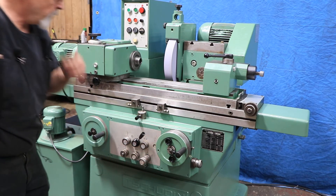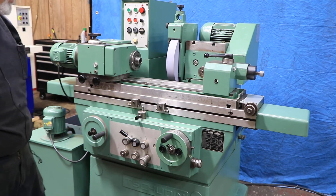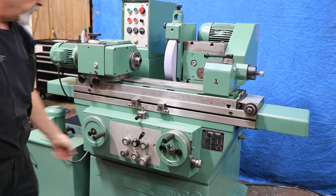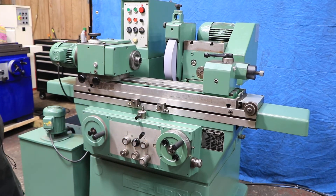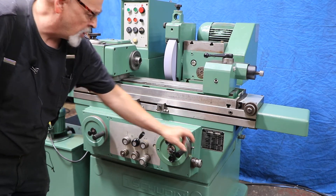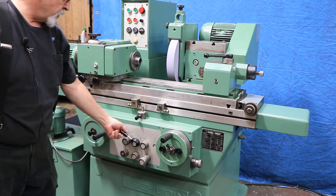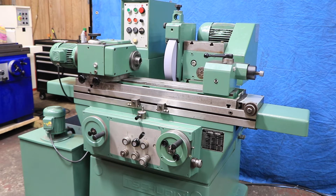I'll open that up. So now you've got two feeds — you don't have to use both. It gets to zero and stays there for a few seconds. You've got a timer up here, a potentiometer — you can set that for different times. So we come in and feed down. There's a little dot on the dial here and a set screw on the side; you can adjust that inner ring to have the fine feed start whenever you want. It's these two knobs down here that control the speed of the coarse feed and the fine feed.